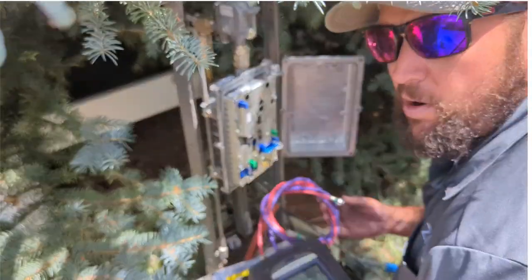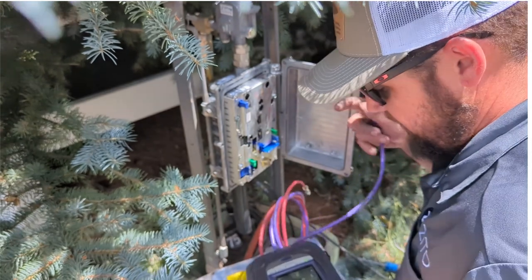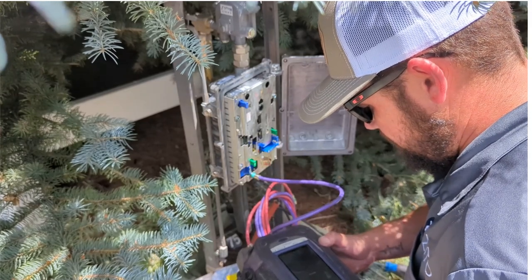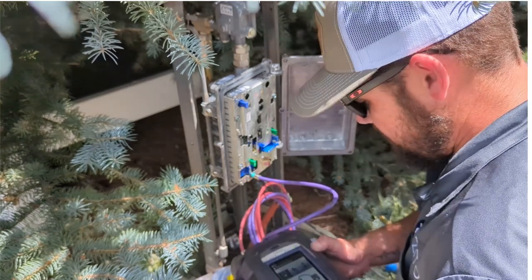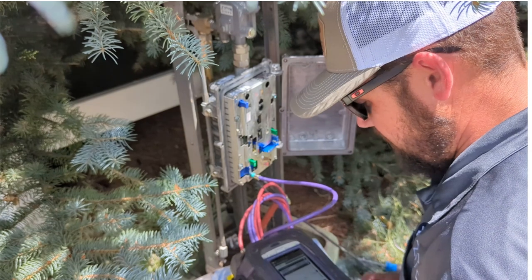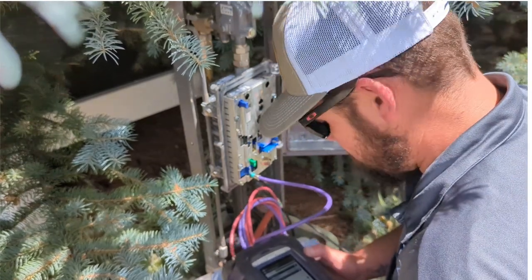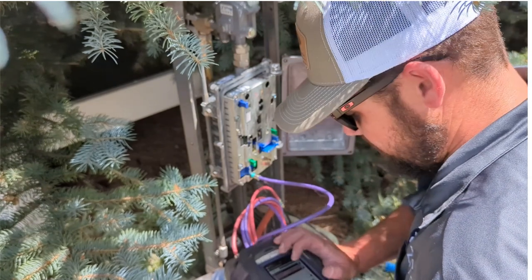I've got two jumpers on this one — one for tracking noise and one for actually setting levels. The first thing I'm going to check is my input levels on the channel check, getting my downstream frequencies lined up first. My phone keeps overheating so this video is going to be a little gappy. Basically I'm looking to make sure I do have downstream and I didn't mess up my fittings when I cut it in. I do have downstream, but there's a terrible reverse tilt — just awful. We'll have to correct that with the forward equalizer pads.